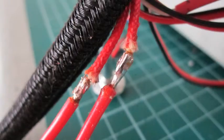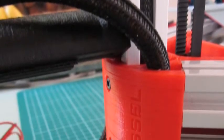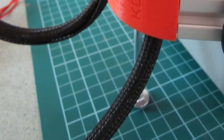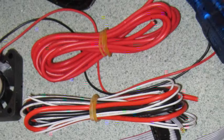For the extension I cut about three millimetres, stripped that back and fanned it out. On the other woven cable I did the same — fanned both ends and pushed them together to lock, then squashed it back and soldered it. That makes a solid joint rather than wrapping one wire around the other, keeping it small and compact so it will fit through the drill hole.